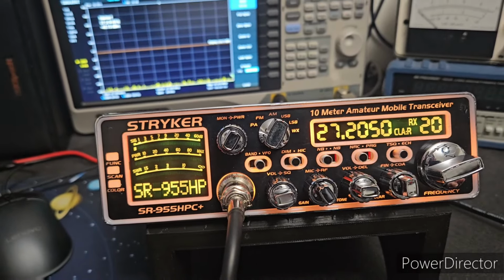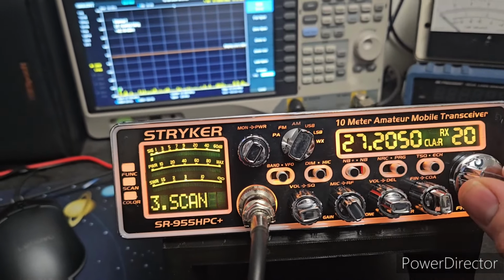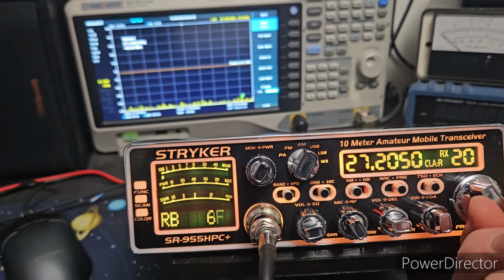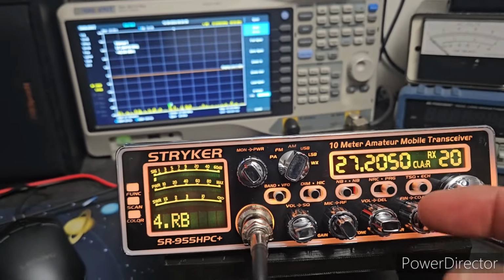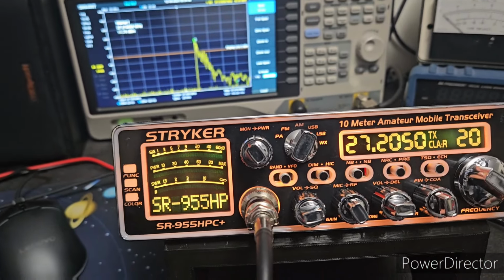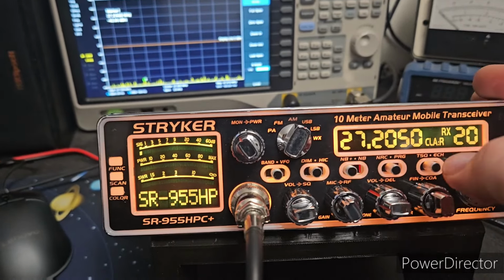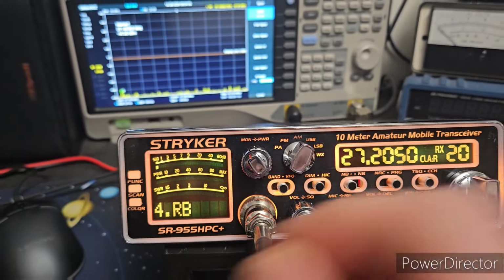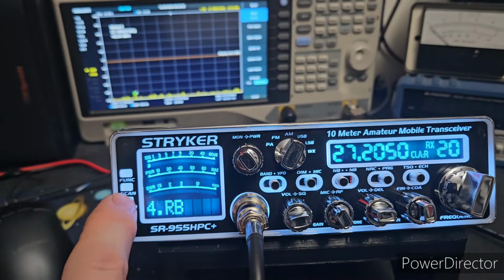So I did give you a Roger beep. If we go into the program here, and go to RB and hit function, I think we have to hit, yep, and we go to 6, and now let me turn on the monitor function. Did I turn it on? Yeah, it's on, okay. So old like Lincoln or HR2510. There's other ones that are pre-programmed in there, so that's up to you if you want to run them. But that's the one that I put in. Wrong one. So I'll shut them off, but just to show you what I did. Whoops, I hit the wrong button.